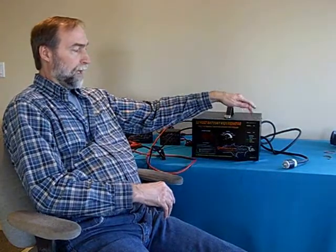When you put it on the cycle mode, there's a second set of circuitry that will actually load the battery. It has a built-in set of load resistors and fans to dissipate the battery. So what it does is charge it up to the top and then discharge it through its normal discharge cycle. By a series of charges and discharges it will break down sulfation in the deeper layers of the battery and rebuild its natural capacity to hold charge and lower its internal impedance, so it can run for longer periods of time under your loads. This is what we refer to as rejuvenation.